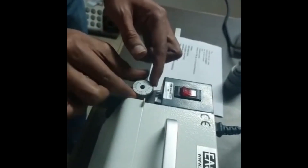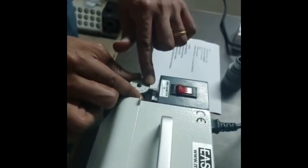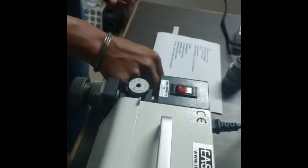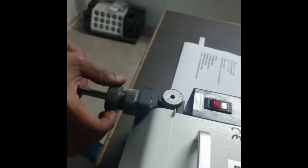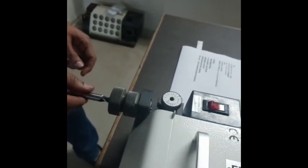Here we adjust the diameter to 10.5mm — in between 10 and 11mm. Finally, we put the drill in and butt it against the end stop in the Z axis, also moving it in the clockwise direction.